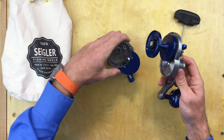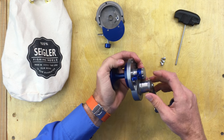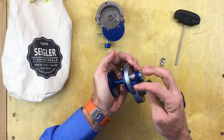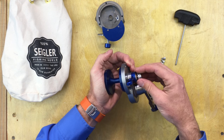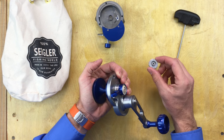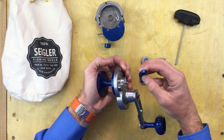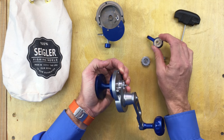I'm going to take it down a little step further. I'm going to hold the spool in my left hand, cup it, and then grab the preset knob. While it's in free spool, I'm going to loosen it counter-clockwise — off it comes. There's your preset knob. Then you're going to take your drag lever off right here. It's got your cam inside — a little gold-looking piece.